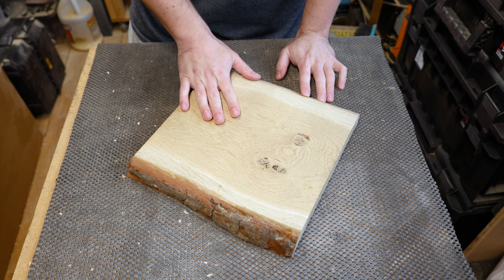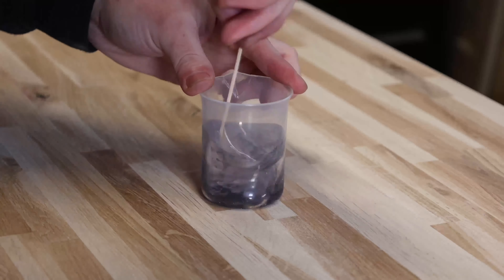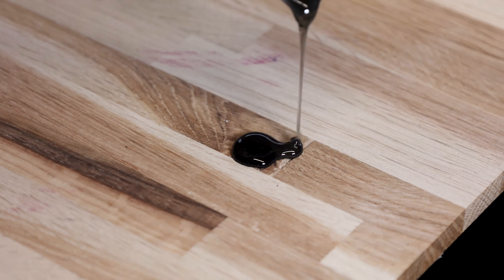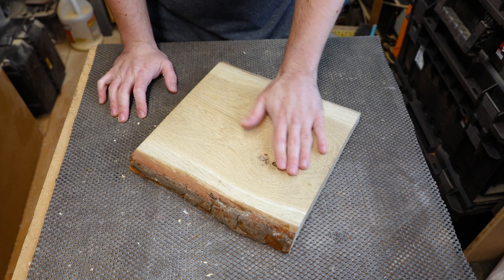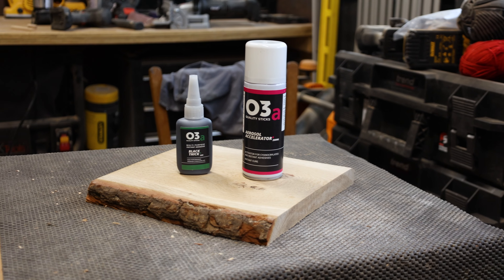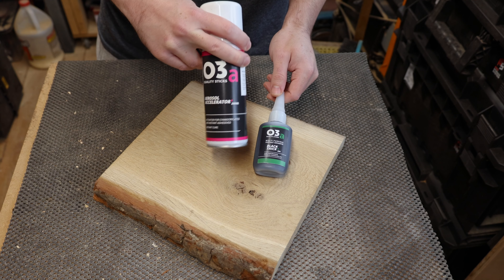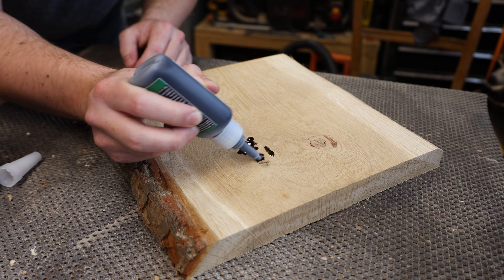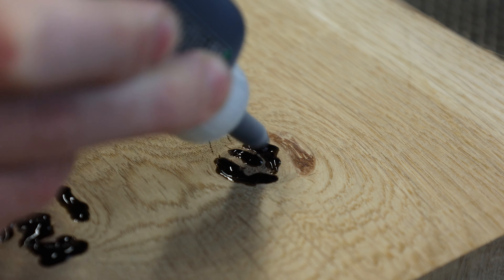That's my rough square cut. Before I get to any sanding, I've got to deal with these knots and voids. Traditionally I'd fill these with a resin or epoxy putty like Milliput — mix it up, pour it in, leave it to set. Resin takes a couple of days to sand; Milliput is usually good the next day. But I've been looking for something quicker, and that's when I found this black super glue. It's really thick, and I've also got some spray activator which speeds up the setting time. I'm hoping to pour a little bit in, spray to make it set, pour more, spray again, fill the surface, then sand it flush.